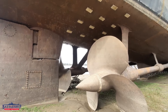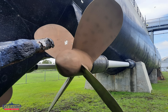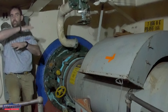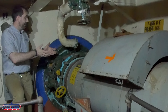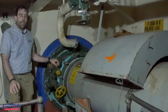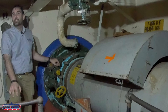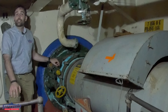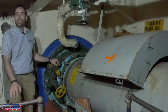Missouri was dry docked in 2009 and retained her propellers. On the other side of things, recently within the last year or two, Midway was having issues where the tide was picking the ship up and down, and she was slamming on the sea floor with her rudders and propellers. That was transmitting shock through this very small opening into the frame of the ship and doing damage over time. So they used divers in situ to remove her propellers and rudders, which is a very cool project. I'm looking forward to hearing more about that at the HINSA conference this year.